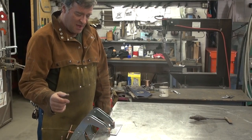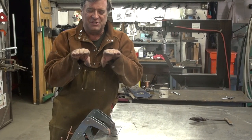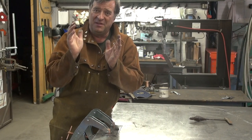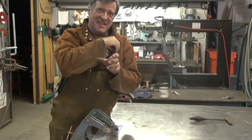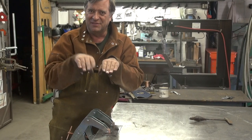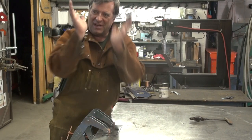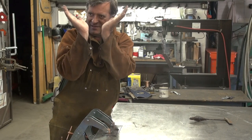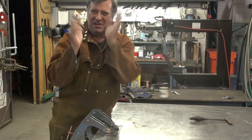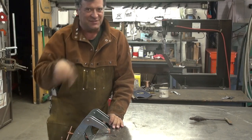You didn't look like you chamfered those. I didn't bother to chamfer these — this is a closed butt joint, because the two pieces of metal are flat up against one another. It's only an eighth of an inch thick, so there really isn't much metal to chamfer, and the welder's plenty strong enough to penetrate that eighth inch in one pass. But you can do either a closed joint or an open joint, just like that little chart showed. Depending on the thickness — if this was quarter inch, I would chamfer the edges and do an open butt joint, with a wide chamfer at the top and a narrow gap at the bottom, and lay a nice bead down in there. It all depends on the thickness: whether you chamfer it, whether you U-shape it, whether you J-cut it — look at that chart, it gives you some good information.